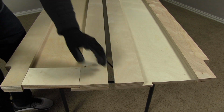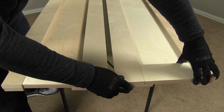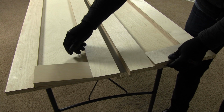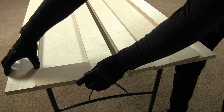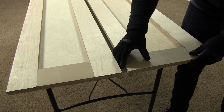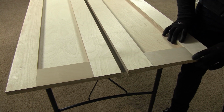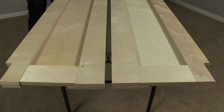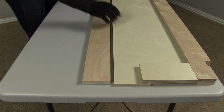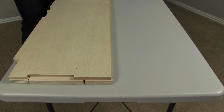You'll have two long pieces that go up the sides, one of which has a notch that corresponds to the baseboard trim cutout on the cabinet side. And then you'll have two short trim pieces for each one. Note that the way I'm laying these out has both sides in a mirror image of each other. So I'll move one of these aside and get started by flipping everything on the other piece upside down here, since the screws come in from this back side.